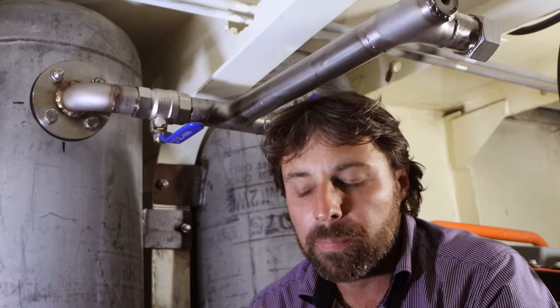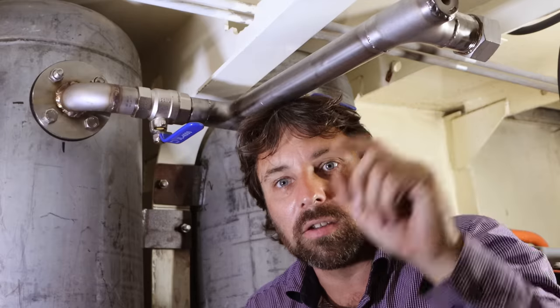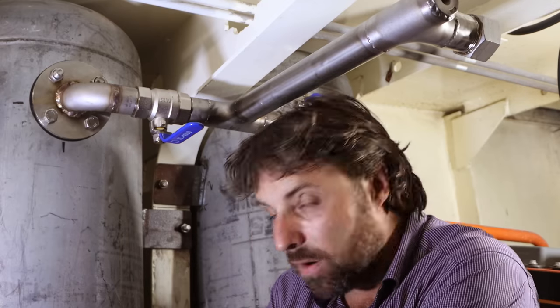Thanks to Andrew Gray — there were a couple of people in the comments that said I had the sensing of the pressure wrong. I thought I had it right — I had it wrong. Andrew took the time and explained why, and it made a lot more sense. The way that I had it, it potentially could have been dangerous. I was wrong — I get it now. So Andrew has worked through a bit of a design and figured out why regulators work the way that they do so he can help me retrofit what I need to do on this. I'm changing the manifold and everything up here so that the sensing and the pressure is not coming via this pipe. I'm actually going to be sensing from the compressor head.